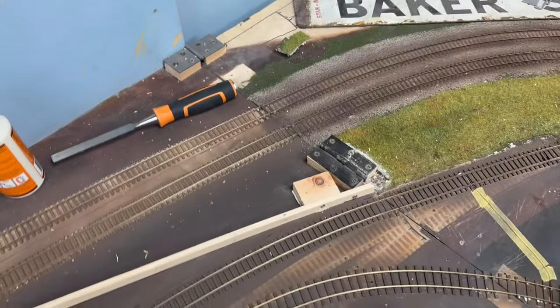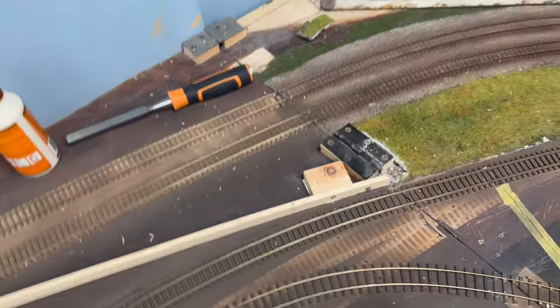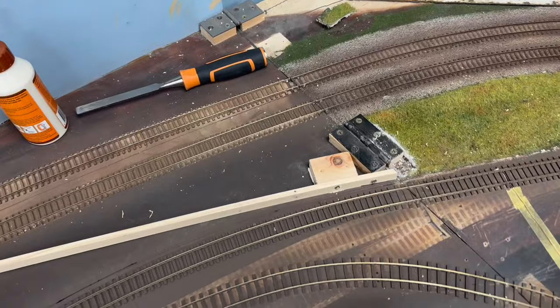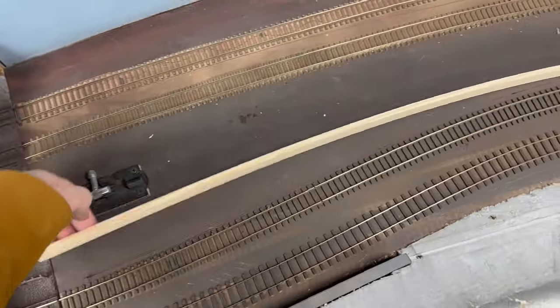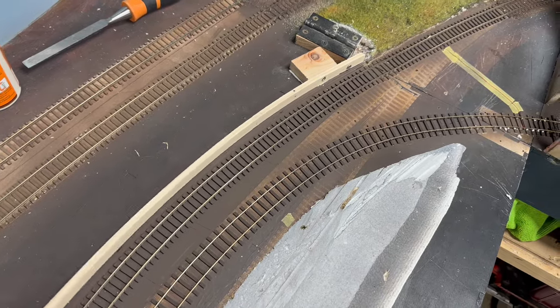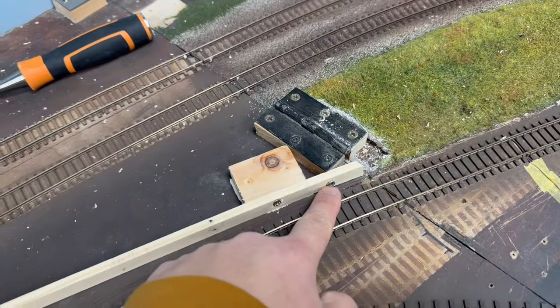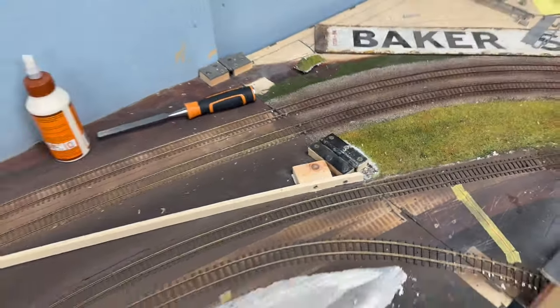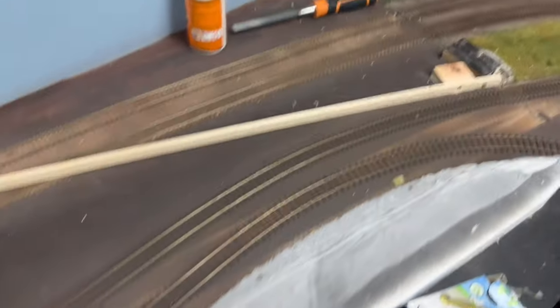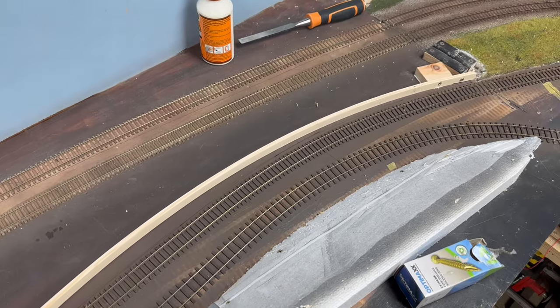Here is the idea - this is the first block in. It's just a five-centimetre long section chopped off, 15mm high - the same height as the hinge. It's screwed in from underneath and it's got wood glue as well, so it'll be nice and strong. What that allows me to do is then bend the strip wood around, and you can see there that I'll keep adding them as I go and it'll give me a nice smooth arc for the platform edge. That's going to gently curve around there and give me my nice curved platform.